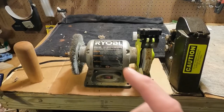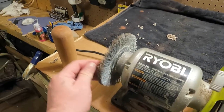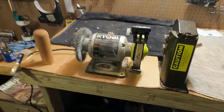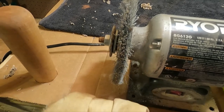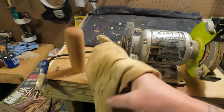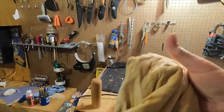I'm going to show you another way to break it to get it even softer — this is where I really figured out how to get it softer. Get your bench grinder and change out for one of these wire wheels. Go with the softer bristles — don't go with the hard ones, it'll tear it all up. Cut it on and just run it back and forth, turn it a little bit, back and forth and turn it, and man it'll really break it and make it a lot softer.